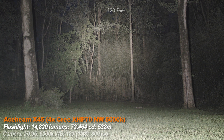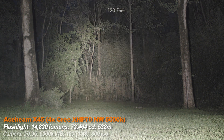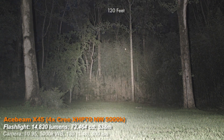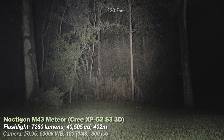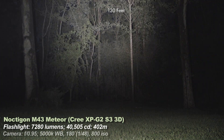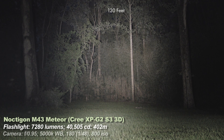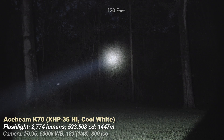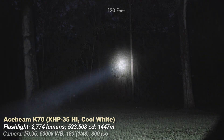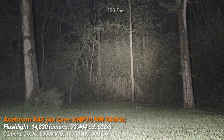The 47's Maelstrom was 15,000 lumens but that's discontinued, and the Imalent DT70 is 16,000 lumens. Now I know my X45 measured under 15,000 lumens, but I'm testing the neutral white version and my equipment isn't professionally calibrated. Now to the Noctagon Meteor — the most compact of my big-lumen lights, with a nice neutral tint around 5000K, and the video responsible for almost a third of my channel views for better or worse. Back to the X45, then the Acebeam K70. The K70 is my throwiest light — highest candela — and will shine light much further into the distance than the X45 even though it's only a fraction of the brightness. The X45 is much floodier, but still no slouch in throw partly due to its immense lumen output.